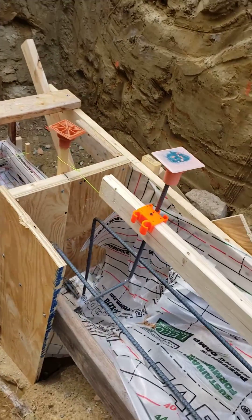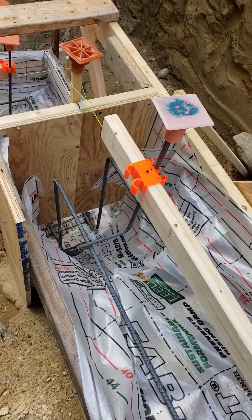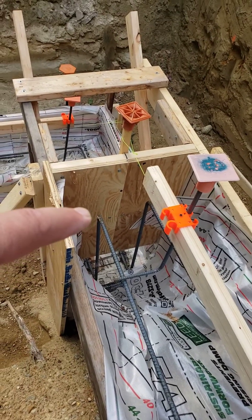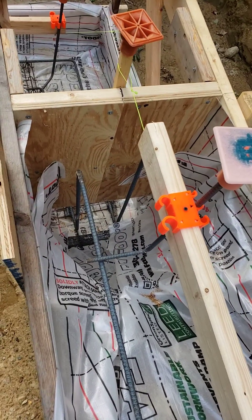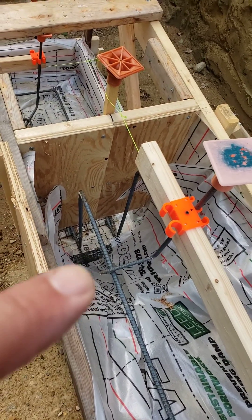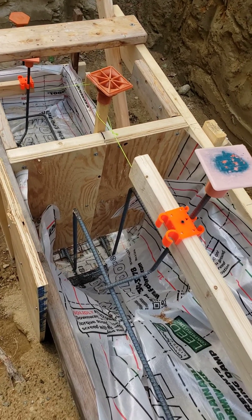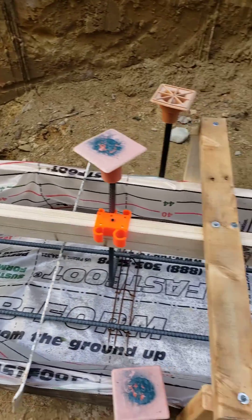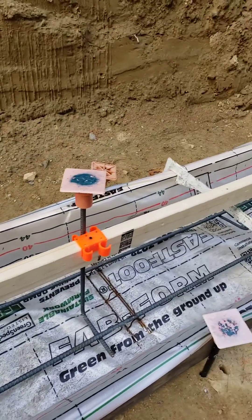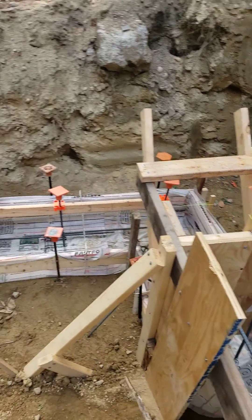Here's how we make up that four-foot difference in the footing. You can see the fast form just kind of conforms and becomes a chute. We have a little end dam of a wall there, and our rebar goes down and makes the Z — you can see it goes down and then goes across and connects to those pieces. And of course our little J-bars here are alternating. So yeah, step footing, walkout.